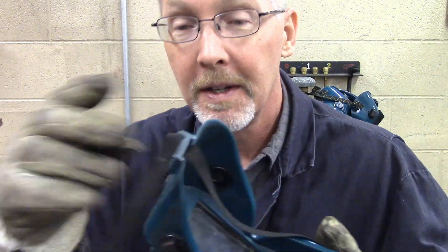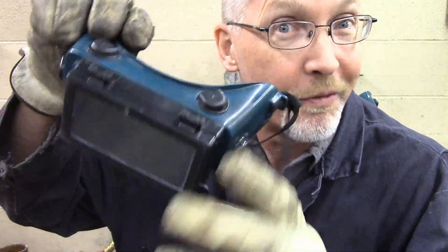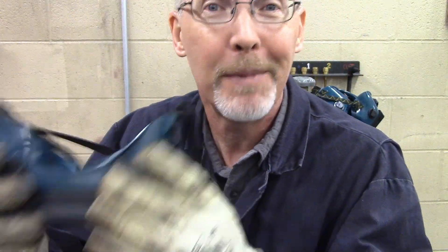First, a little bit of safety. I'm wearing a shop coat. I recommend you wear the leather jackets from the welding booth — it protects your clothes a bit better. I'm also wearing leather gloves; we provide gloves here. I like these ones because they fit tighter to my fingers, giving me a bit of dexterity. I'm going to wear tinted goggles so that I can see what I'm doing. These prevent sparks from getting into your eyes. Make sure you still have these little plugs which prevent the goggles from fogging up.